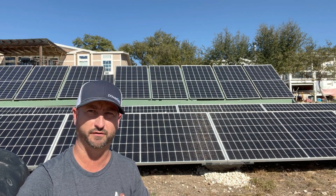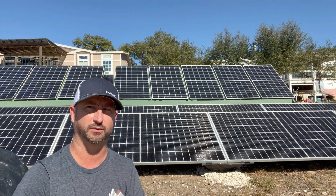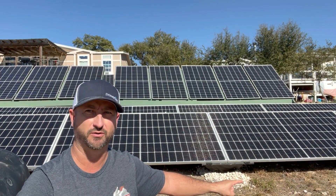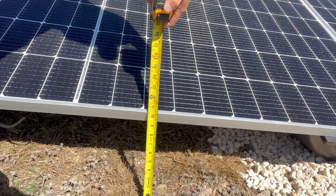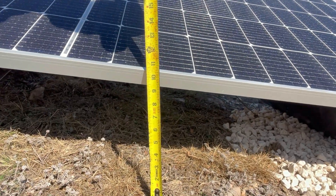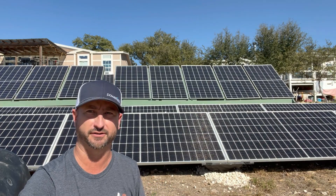It's so important that on the quote form they want the specs of your solar panels so they can double-check that for you. The low profile of these might be a problem in areas that get a lot of snow, because the front edge of the panel is only about nine to ten inches off the ground. If you do get a lot of snow, they're going to start to get covered, so you'll need to go out with a snow blower pretty continuously during storms to keep the snow load off.